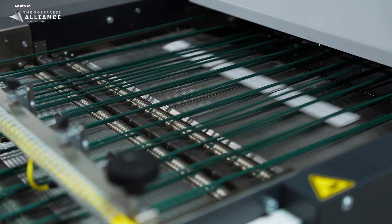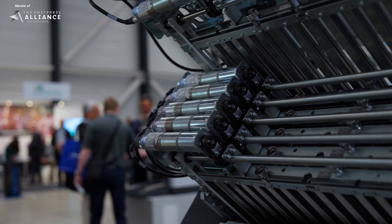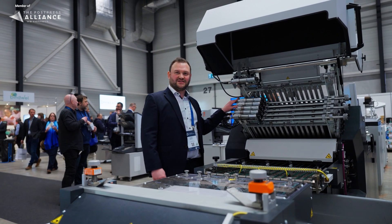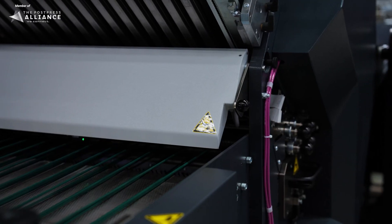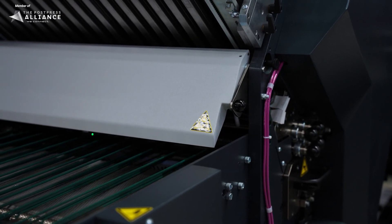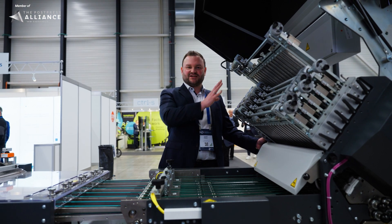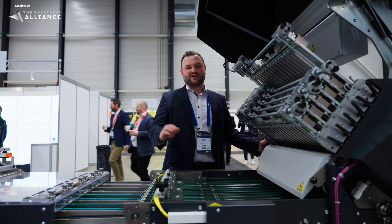This machine is equipped with 12 fully automated buckle plates. The buckle plates are set up from the main screen by the operator and will adjust to their final size in a couple of minutes. We are also automatically setting up our rollers behind these covers — the same as the buckle plates: the operator sets it up from the main screen and it happens in a couple of minutes.